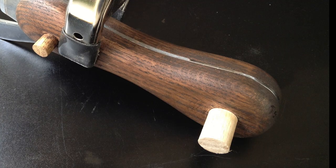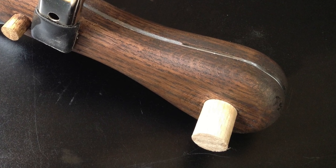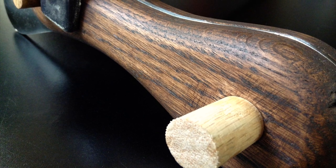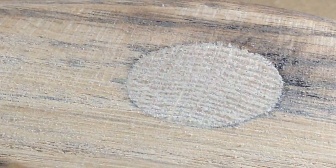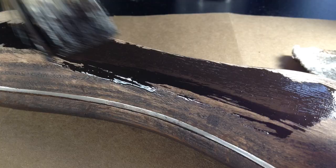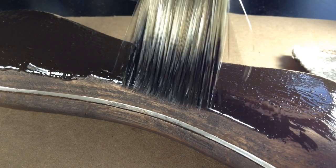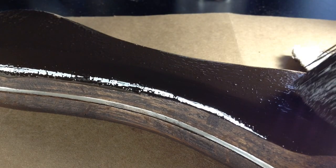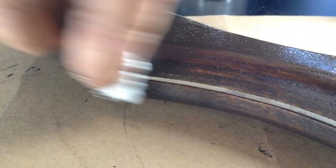It was time to apply the glue and begin the process of final assembly by inserting the dowels, clamping the project, and allowing the glue time to set. While waiting for the glue to dry, I debated the best method for making the dowel flush with the handle. Since this was salvaged wood with plenty of defects and the opener is 40-plus years old, I decided to use the hobby rasp followed by a light sanding, not worrying about any marks the rasp might make. To even out the stain, I gave the tops of the handles a light sanding and applied a final stain coat with a bristle brush, wiping off the excess almost immediately after applying. I gave it a few hours to dry and called this mega bottle opener handle done.